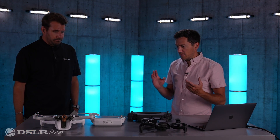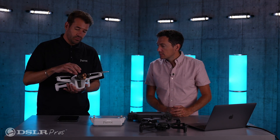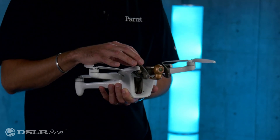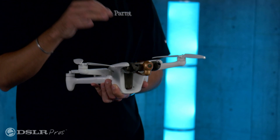Let's talk about the payload because it's obviously a very different design. What does it do differently because it has this design? When you look at the payload, we need to differentiate the different systems we have here. We have two stereoscopic cameras mounted on a pitch-axis gimbal. These two stereoscopic cameras are made to do the sense-and-avoid obstacle avoidance.